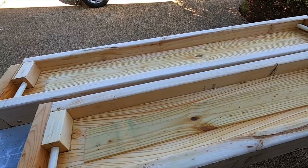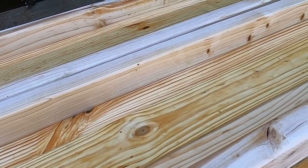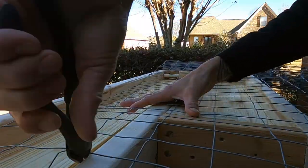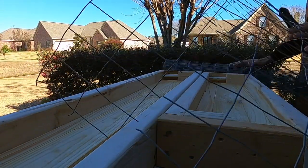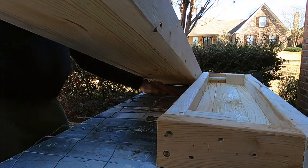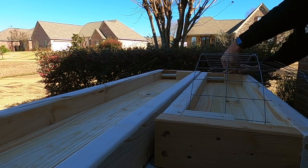I still have to wait for my fibers to come in to mix with the concrete, but we'll get to that shortly. Today is the day to mix and pour the concrete. First I need to cut some garden fencing I got from Lowe's to add reinforcement to the molds. After this first set of blocks, I added some rebar wire ties around the PVC on each side to stabilize the ends better and lock them in when the concrete is poured.